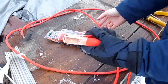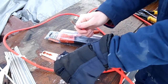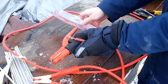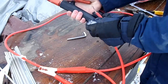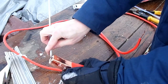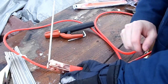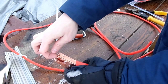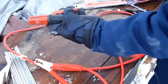First, we're going to upgrade one of these cables, because we don't want two alligator clips on the end. We want an alligator clip to hook to the battery and the electrode holder on the other end. The problem is trying to hold a welding rod with an alligator clip — it's a pain, and if the rod gets stuck there's not much connection, so you just start melting your alligator clip.